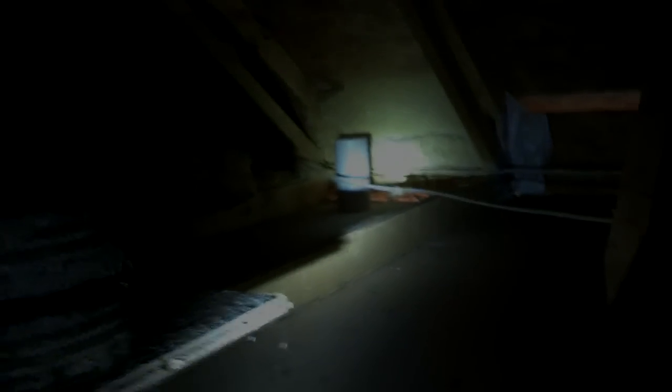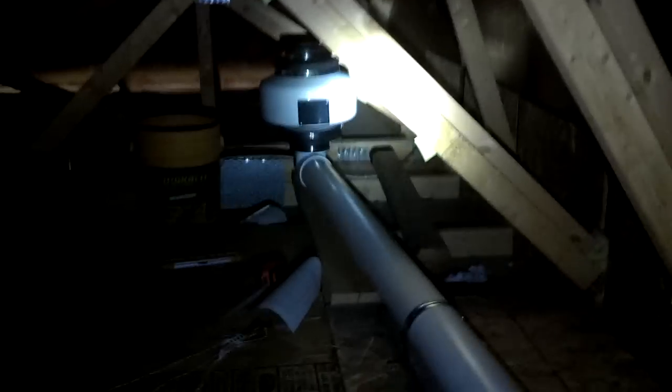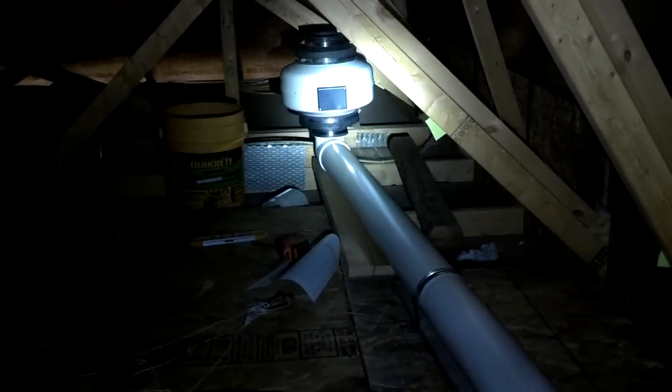Here's the pipe coming up into the attic. We'll put a 90 on this and make sure it has about a 3% pitch so that any water coming down it will go right down into the sump. This is the pipe in place as it runs over to the side of the house where I've got most of my plumbing pipes, so it won't be in the front of the house. We've got a very large fan there that we're putting on it — that fan is made to handle some moisture and has boots on the top and the bottom to connect to the 4-inch pipe. It's got an electrical box on it so you can hard-wire your Romex right to it, then run that to a switch and then to a breaker. We need to cut our hole for the cozy boot so we can put the pipe to the outside.